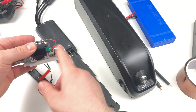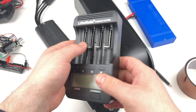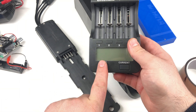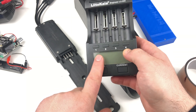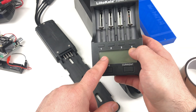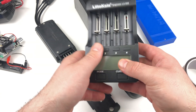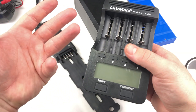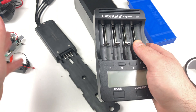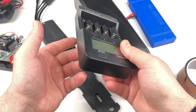If you don't want to buy a load tester, you can buy this kind of battery charger — it has a load tester built in and will tell you the capacity of the cells. It takes a lot of time and you can't configure how many amps you want for the discharge — I believe it does a discharge at half an amp. If you're patient and don't plan to test every single cell individually, I think just buying this charger will be perfect, and it's not that expensive.